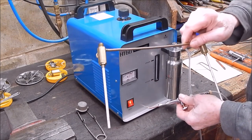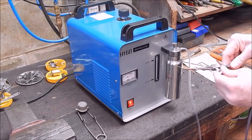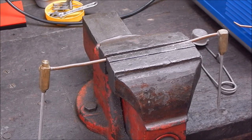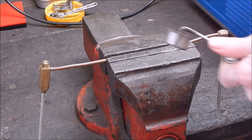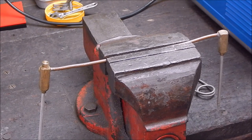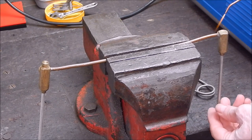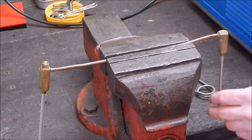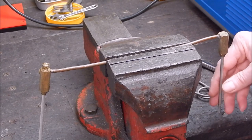So now we'll pull this apart and stick it in the vise. I've been thinking of what I can use this thing for and this is the perfect job. Whoa, look at that baby go. So now we'll just give it a bit of heat. I'll be gentle with it - there could be a rubber seal in this valve. In fact, I think I'll take the shafts out, because if there's a seal there I don't want to risk buggering them up.